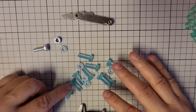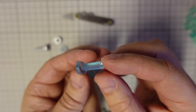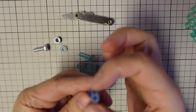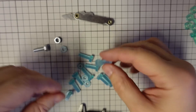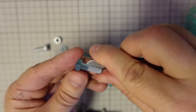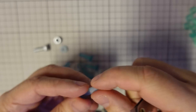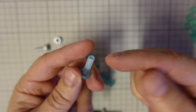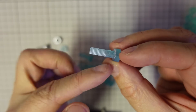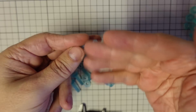These bolts are printed on the Elegoo Mars and I really like the transparent blue color — they look great. The only problem is they are a little bit oversized in the X-Y direction; in the Z direction they are fine. So I used a die tool to clean the thread. I only had to reduce less than 0.1 mm in X-Y, but that was enough to lose that beautiful transparent color.